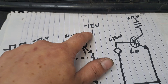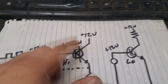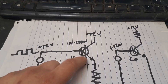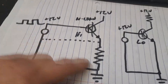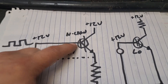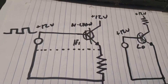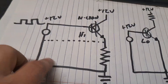If you've got a max drain voltage of 300 volts on a switch and the threshold is 4 volts, you're going to feed it 12 volts — what are you going to do, throw 312 volts across the gate? Well, technically yes, reference to ground. But you're not going to put 312 volts across VGS because VGS absolute max is only going to be like 20 volts and you'd blow it up.